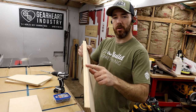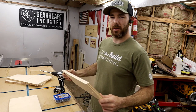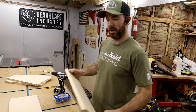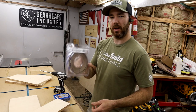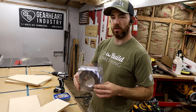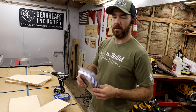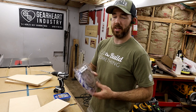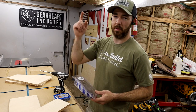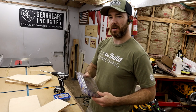You could just stop here and leave the edge exposed so you see the layers of plywood, but I want to add some contrast and make it a little more unique. I grabbed some walnut edge banding I had left over — this is from FastCap. It's just stick-on, so you pressure-roll it on, trim off the edges, and you're good to go — no iron or anything. If you want more information on how to apply it, I made a video on it linked below.